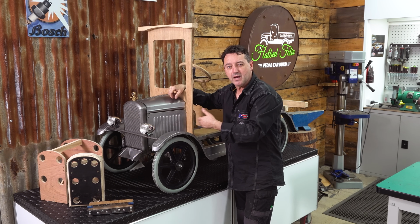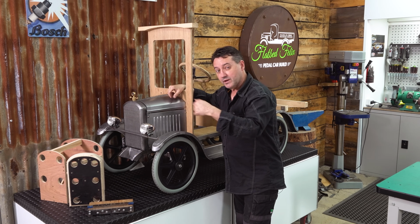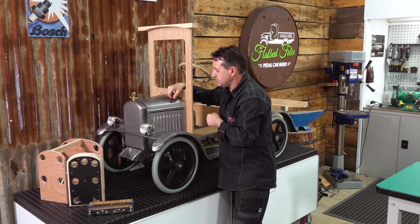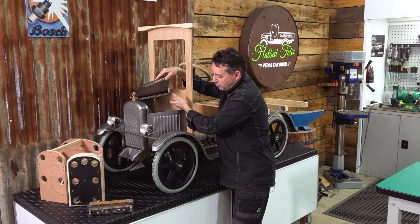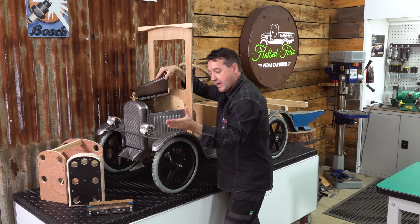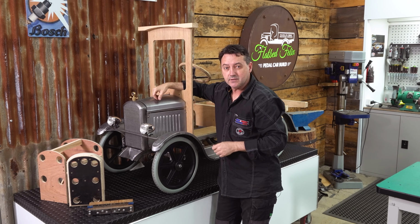During the making of our parts and components, we'll be using all the skills that we've already covered. We'll be developing them even further. Metal shaping, shrinking, stretching, metal finishing, swaging, louvers, even machining work. Even something like this firewall that is identical to the back of our forming buck. Making the panels that then fit together and we can bolt it all together on the car. So let's get to the plans.